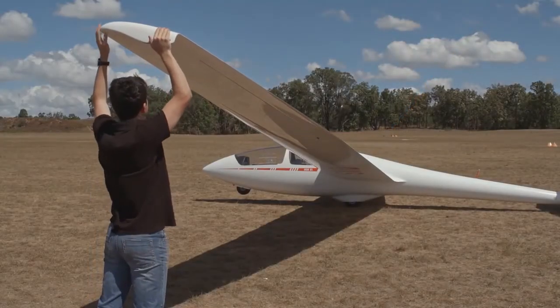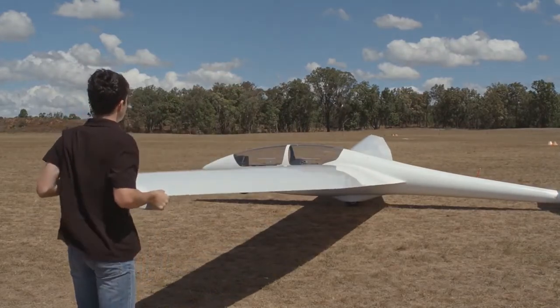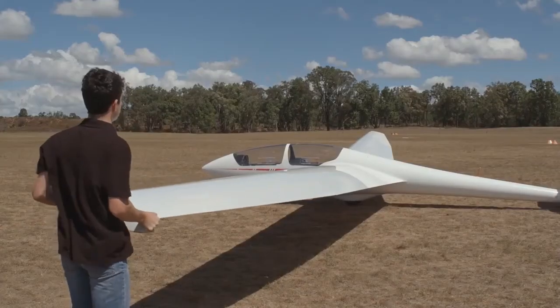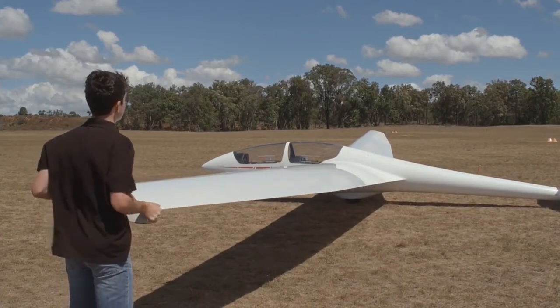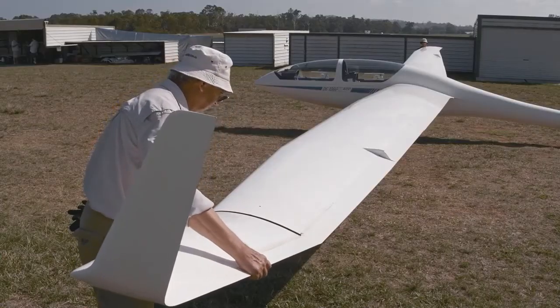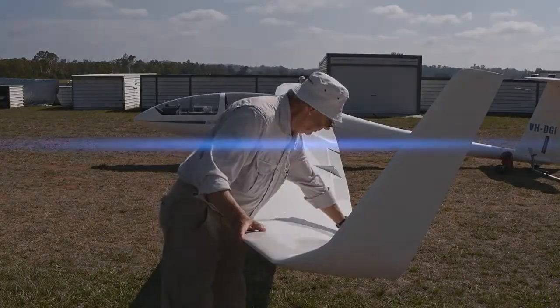Safety of the wing attachment can be checked by a simple shake of the wing, but not too hard. First up and down, checking that the wing tip on the other end moves up and down at the same time, then forwards and backwards. The fore and aft test is particularly useful on two-seaters or those with large wings to make sure that the drag pins have been correctly fitted. Finally, if you have any winglets or extensions fitted, make sure they are also secure.